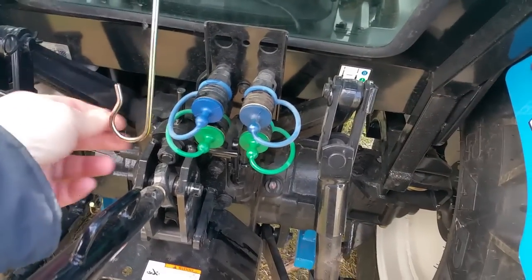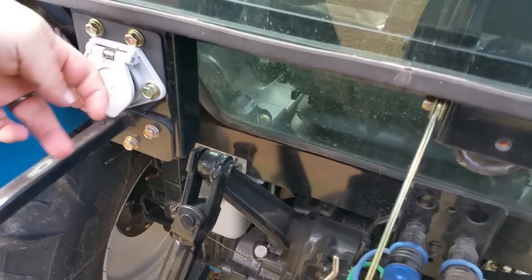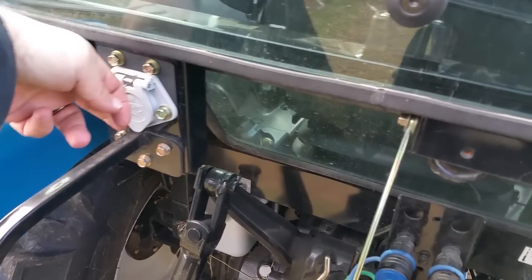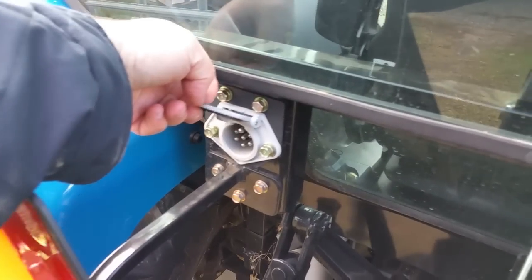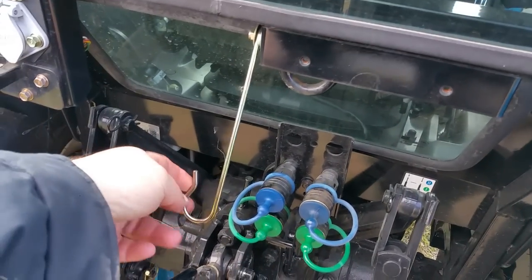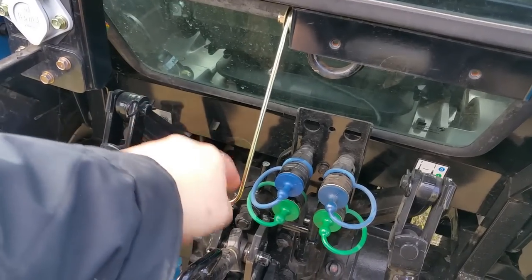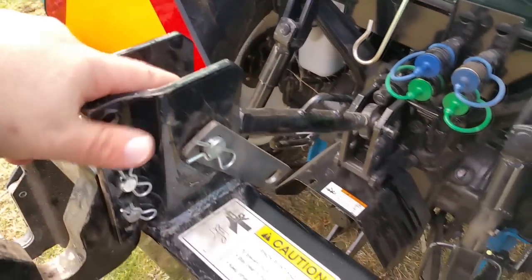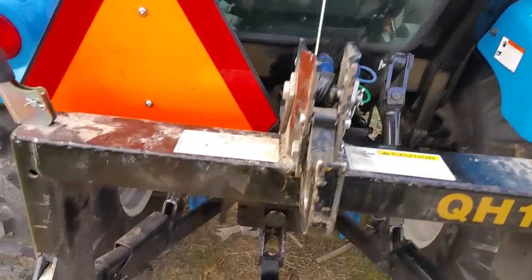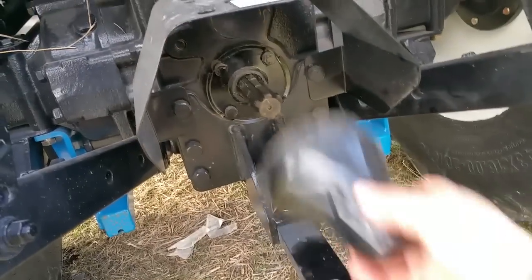This right here is a nice touch that the New Holland's didn't have — it's a standard 7-pin round agricultural connector, basically the same thing as what you'd find on an RV trailer, but without brakes — just an auxiliary pin. You could hang your cable and plug it into here with a spring so it doesn't lay on the ground. Or if you don't have an implement and don't have a quick hitch, this hooks on here and holds your top link out of the way so you're not dragging. It also comes with a PTO cover to keep your PTO clean when not in use — that's a nice feature.